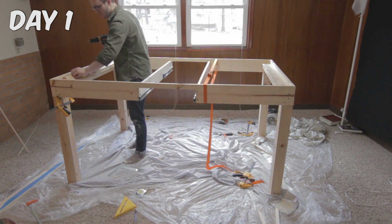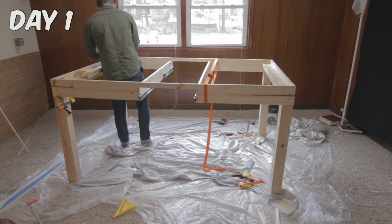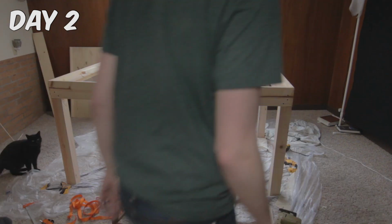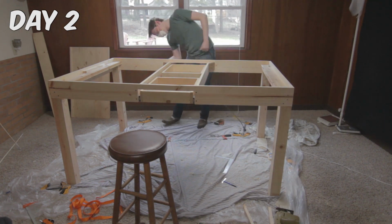While screwing these in place, we fitted the drawers to make sure they fit correctly and slid easily. Having these 2 parallel drawers was a major pain in terms of ensuring they were straight in every dimension in order to allow for easy sliding. If I had to redo this table, I would avoid its design and see how I could make them separate.